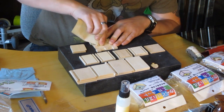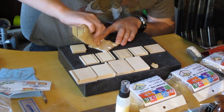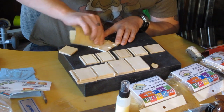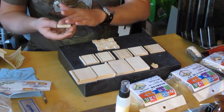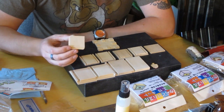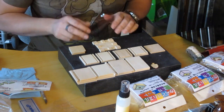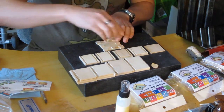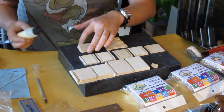It's a little bit rough in there, and when you're gluing you'll find if you have a smooth surface you'll get a much better glue joint than if you have a rough surface. So it doesn't do any harm just to clean things up. Doesn't take much, just enough to clean that surface up. You'll find because these are all probably a birch finished plywood, that the surfaces are all pretty good anyway, so you're not going to have to do a lot of work. So with that oriented correctly, we're going to glue that one in piece. It's not going to take a lot of glue, so you'll see as I glue this up how much I'm using. As I say, it's not going to be a lot.